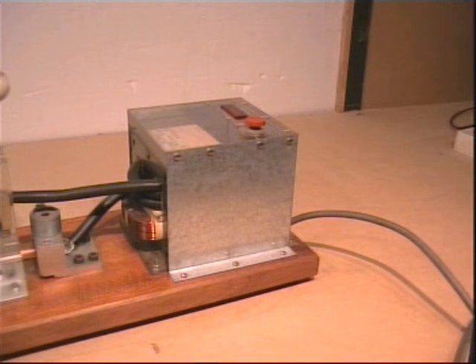Although the output voltage is low and therefore quite safe to handle, it is still powered by the mains. Because of this, I have enclosed the transformer in a box. The ends of the box are made of perforated zinc to encourage the circulation of air, the front one being omitted here for the purpose of clarity. I have included a neon confirming the unit is plugged in, and a push to make switch to energize the primary. You could, if you wish, make a timing device, but in order to keep this project as simple as possible, I have omitted one here.